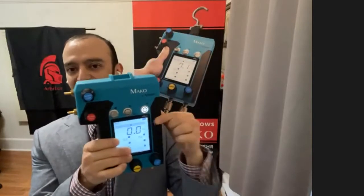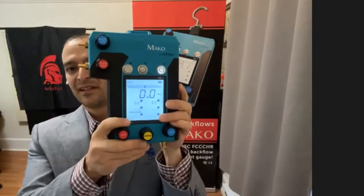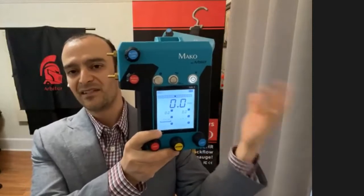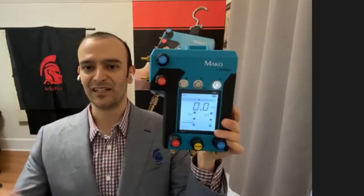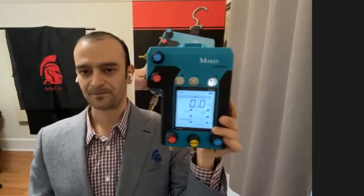But a secondary function of it is it runs right through the sensor, so it's right in line with the sensor. This is really handy if you're leveling the gauge with either a sight tube, sight hose, or with an assembly as part of one of your test procedures. You often have to level the gauge with something. This line gives you a really clear mark where you can level the gauge.